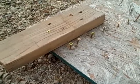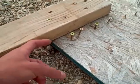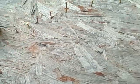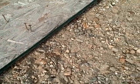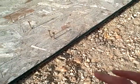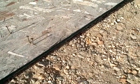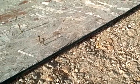So to use it, basically just stick the piece of conduit in to about here so that it lines up down the tunnel, and then grab the end and then just start bending it around the curve until you come out to this side. And then if you have any extra over here, just cut it off at about 6 inches. I did have a piece of wood over on this side, but it was kind of a pain to get it to lock in there, and I had to fight the metal.